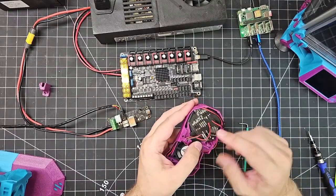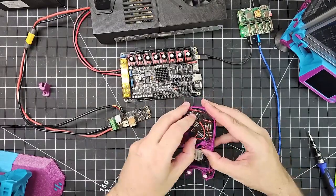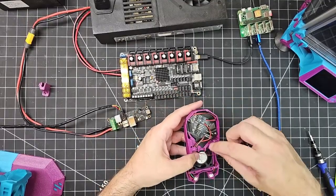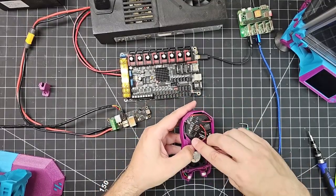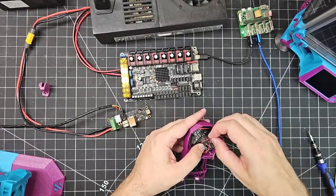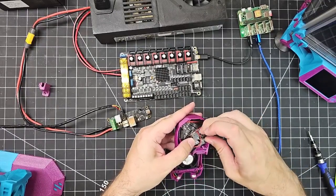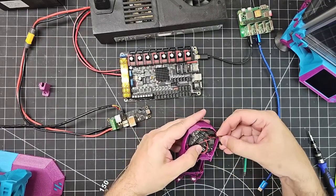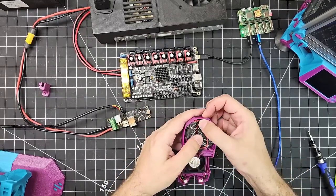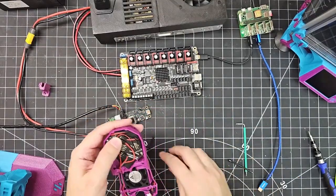You may be wondering why this connector is on a bit of an angle — I left myself a little short on the wires, and that's my fault. I've got to bend them a little bit, but it doesn't really affect the functionality at all. Then finally for this, we're going to attach the red to five volts and the black to ground. That sticks into place.